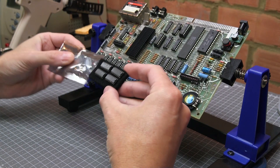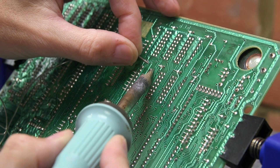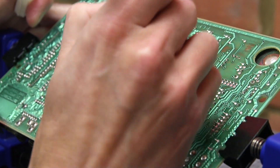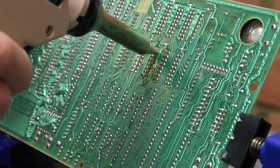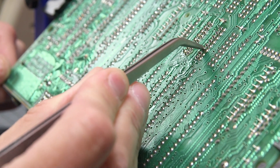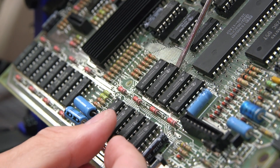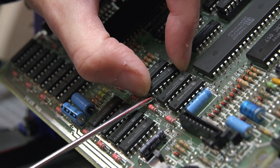A couple of days later and some new RAM has arrived. IC21 is the chip to replace, and first of all I'm adding some fresh solder to the contacts which should promote better desoldering. I'm also applying some flux using a flux pen to dispense a small amount onto the board. I check that each of those legs is free — the chip is moving — so we can very gently lift it up. Be very careful not to damage any tracks that may be underneath the chip with the screwdriver. And there she is.